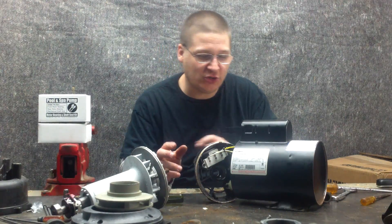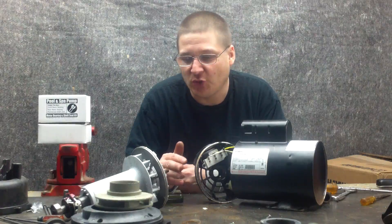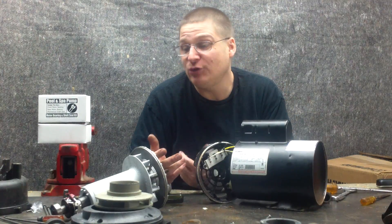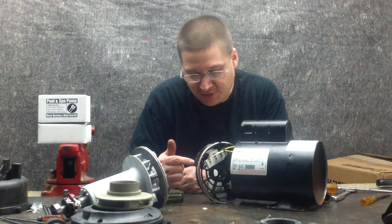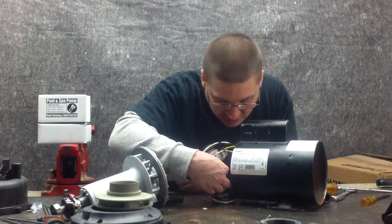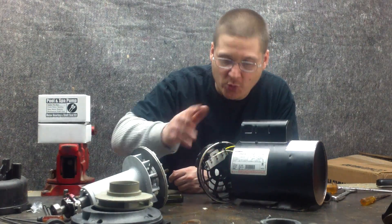See what happens a lot — and I'm going to show you up close in a minute because this is a perfect situation. I knocked off that rear end bell. That's why you probably saw me at the beginning of this video wondering why I wasn't putting the armature back in yet. I was going to put the armature back in, but then I was like, let me show them this because people always ask me about that. When I opened it up, I saw this one bearing spacer, and then as I looked down I saw something else, so I'm going to move the camera close and show you what else I found.